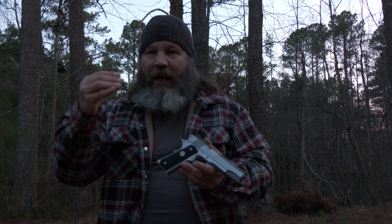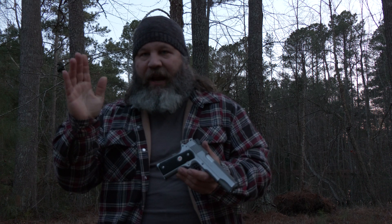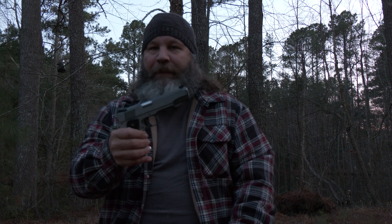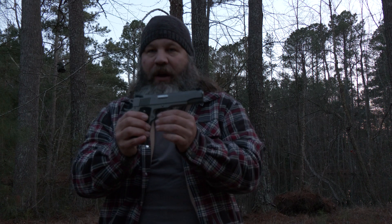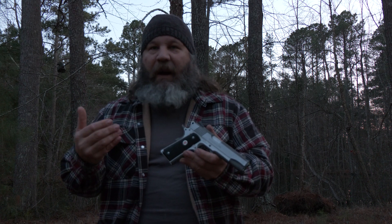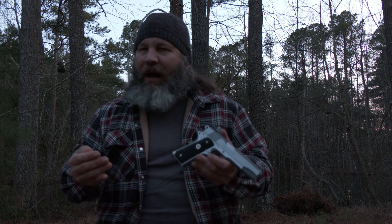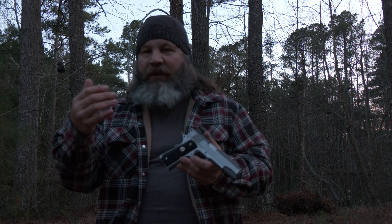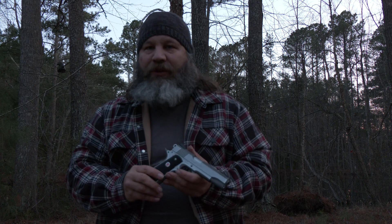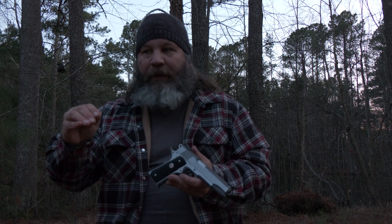Now, when you've got that really nice, beautiful trigger job with that knife edge — beautiful, clean, perfect knife edge on your sear engaged with the hammer hooks — that's certainly going to make the trigger pull better. But if you start dropping that slide on the empty chamber, what's going to happen is that trigger is going to move around and it's bumping the disconnector. And that disconnector is bumping the sear, and that sear is probably trying to do a little bit of moving inside those hammer hooks. What could happen and what will happen over time is it's going to begin to damage your nice trigger pull — damaging that sear, the leading edge of the sear, the hammer hooks.